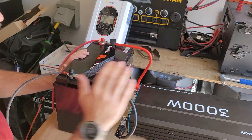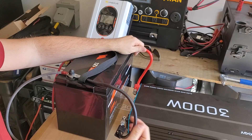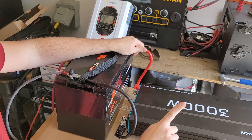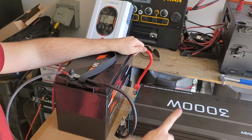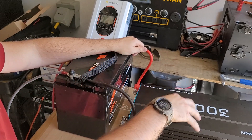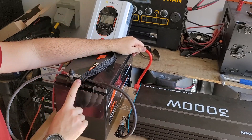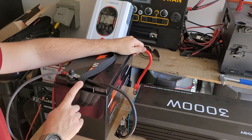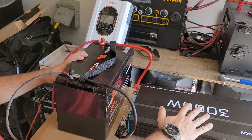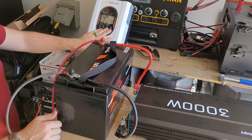I've got the battery here, inverter here, charge controller here. These cables right here are going to the inverter. Now this is a 12 volt only setup, so I can't connect two 12 volt batteries in series making it 24 volts to this inverter, and that's perfectly fine. But to connect to the Titan I do need two of these in series to be 24 volts.